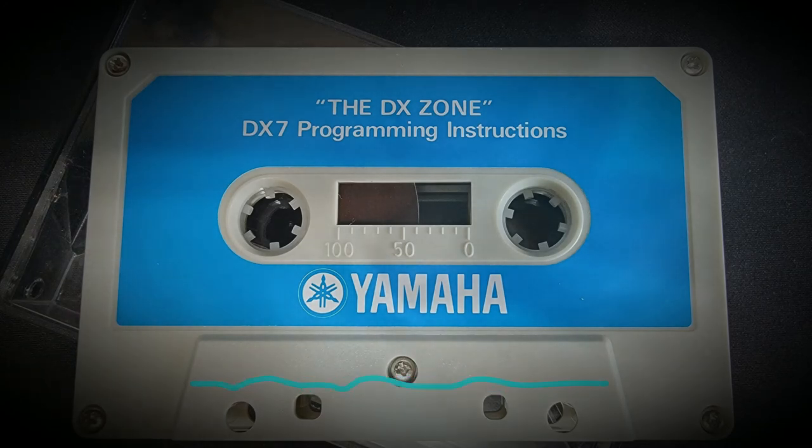In order for this tutorial to be as clear and helpful as possible, your DX should be set to certain known values. Press the brown function select switch and look at the LCD display — the top line will read 'Function Select.' Press switch 1 from the group of 32 green-numbered switches to the right of the display, then sequentially press 2, 3, 4, and so forth to switch 32, reading the message in the display after each switch. Reading the labels under each numbered switch confirms the name of the function available.